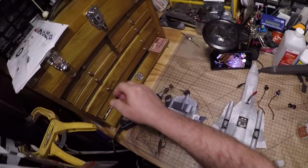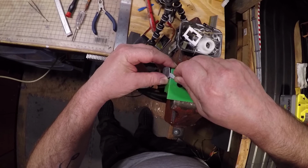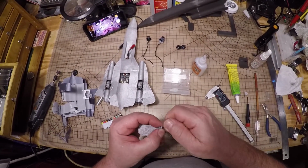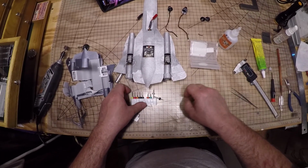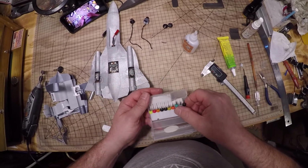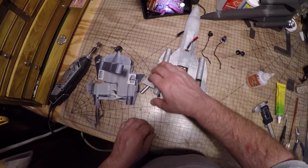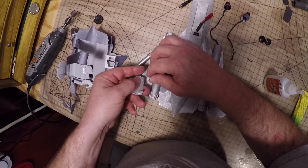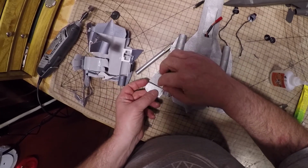And for the hole. Okay, over here I cut forward a little. I didn't show you doing the first one, but I'm taking a little finger drill. The wire coming off the servo is about 0.5 millimeter. I used a 0.66 millimeter finger drill. You can't print that out, obviously. That's too small of a hole. The foaming of the lightweight PLA wouldn't allow that hole to happen. So it's not in there, and you just eyeball it, make sure that the hole is over the hinge point, and leave enough meat on there. You know, you can measure it out if you want and center it in the top part of the control horn there. And then I'm just putting the wire through the control horn, and then we'll do the hinge tape.